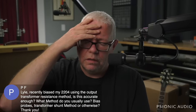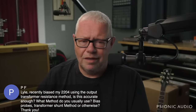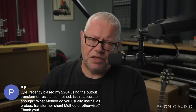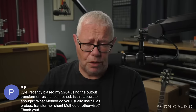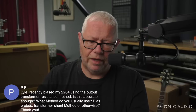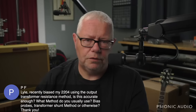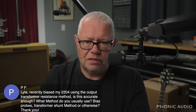I was looking back at that video where I'm disconnecting the 10 nanofarad shunt cap on that plate resistor on the Bassman. I'm thinking, maybe I shouldn't have put that on YouTube, because I'm literally holding the cap and connecting and disconnecting it with my fingers. Someone might not understand that the body of that capacitor has no voltage on it, but if I were to touch the lead, I would. Also, I didn't show that before I desoldered that, I powered the amp off and discharged it, because it looks in the video like I just suddenly start desoldering and the amp might still be on, which you don't want to solder to a live B+ connection. So the presentation on YouTube is not always the same thing as the real work. And I don't mean that in any deceptive way. Just some stuff is not safe for prime time.